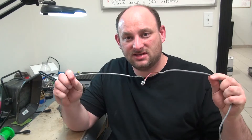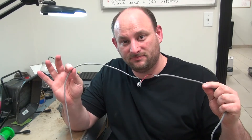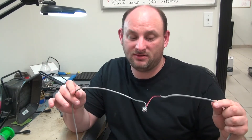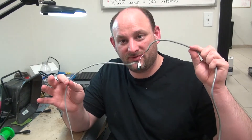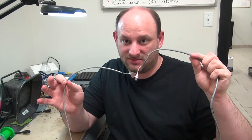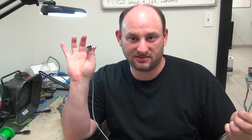The second step will be a little more intricate. It involves taking our 3-wire but the other side now and putting it into this 9-pin along with the 5 wires off of this cord. The opposite end of the other cord here is just bare wires so we don't need to do anything after that. The end result is the one end here is a 9-pin female connector and this end here is a 9-pin male connector.